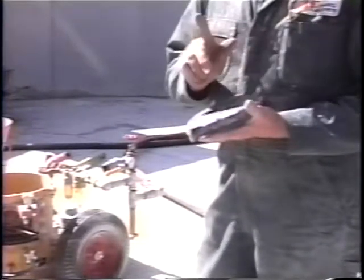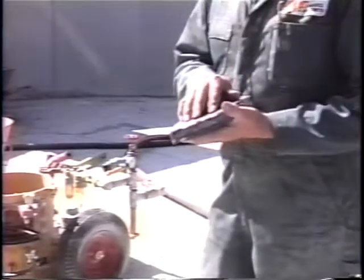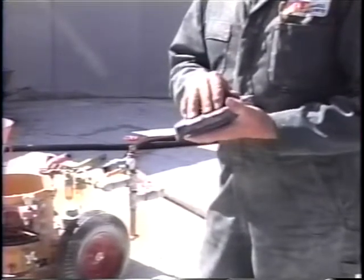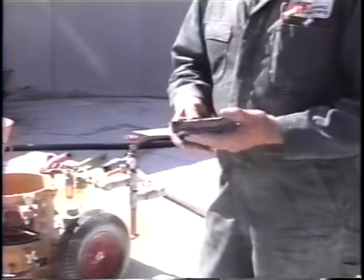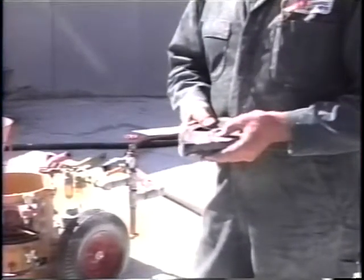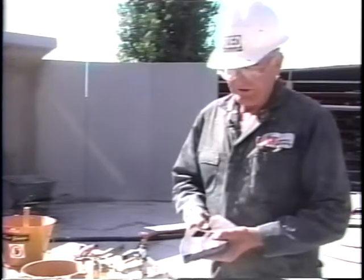And keep in mind also that the wear plate is 1.5 inches to start with. You can turn that down probably 7-8 times down to the minimum of 1 inch. But the deeper you groove the wear pad, the more you must take off on the grinding, and therefore you're going to get fewer turns out of that wear plate. I'd better change these every 4 hours on a material that's very rough on them, and keep the wear plate on, and not have to replace that all the time.